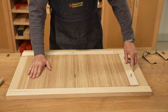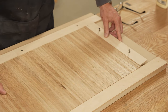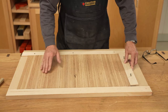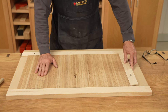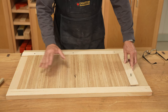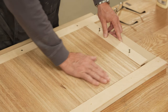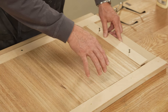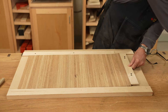Once I've got all my strips in place, I'm pushing my stop block up against there to make sure I can close up any gaps. Because obviously when you're cutting some of these they can kind of twist and bow. If they're really bad, go ahead and make sure you make extra slats so you can get rid of the ones that just don't really want to come together. The importance of this is that once we apply glue to this panel, we don't want glue going down inside those cracks. So now I'm going to tighten this up and secure my stop.